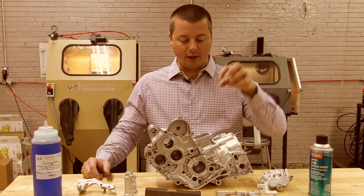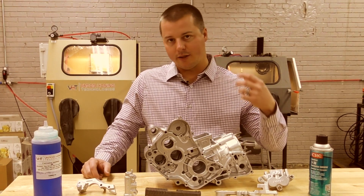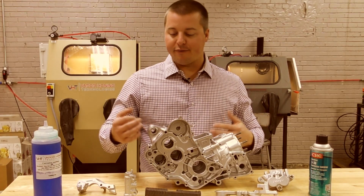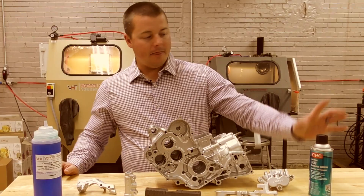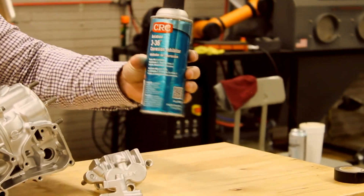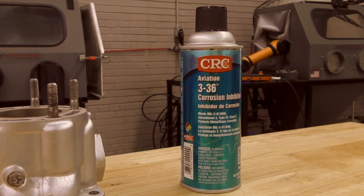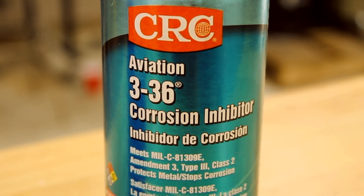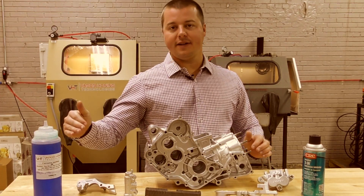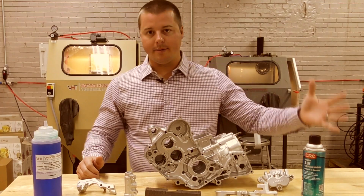Now to the aluminum. A lot of people are scared that aluminum is going to start creating white powder or oxidation, which is actually corroding. They're afraid that you're going to blast this engine and then it's going to be completely tarnished and weak. There's a product for that. It's an aerosol spray — something you spray on aircraft to keep corrosion down on the wings or the fuselage. That's what this is for. You can spray this after you blast. This actually goes into the machine itself to protect ferrous metals, but this is something you spray on and wipe down after.